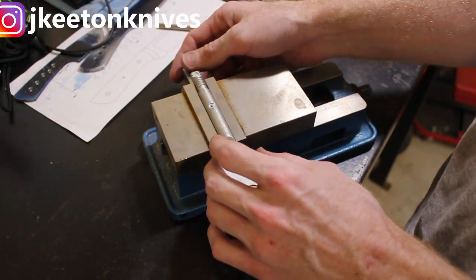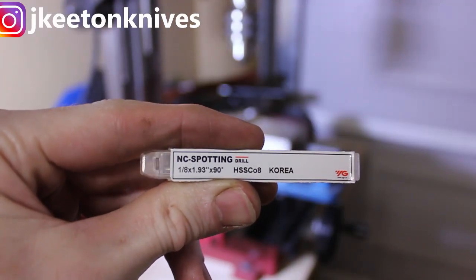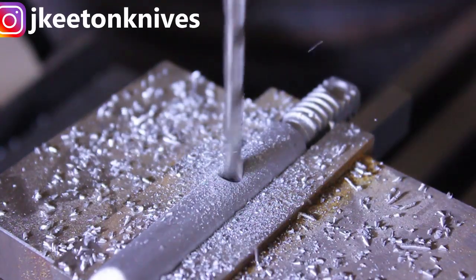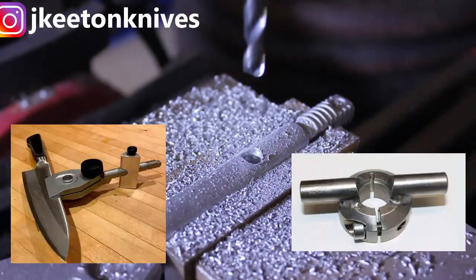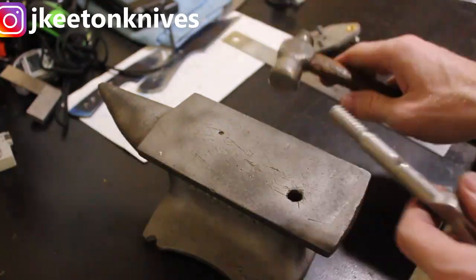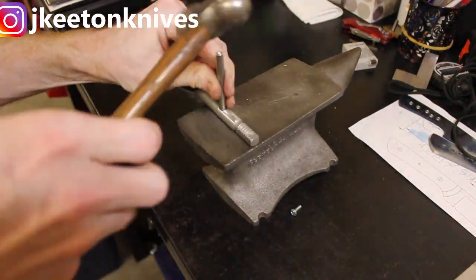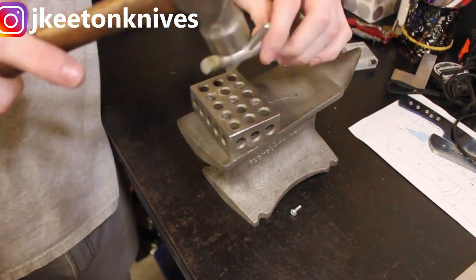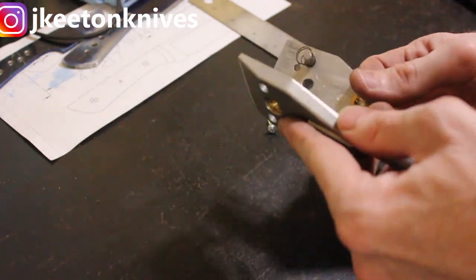There are modifications you can make to the knife grinding jig to achieve a consistent bevel angle. I'm using a quick and dirty brute-force method — drilling a hole in the jig starting with an eighth-inch spotting drill, then increasing it to 5/16 inch to accept a bar I had in stock. There are more elegant designs that allow you to move the bar up and down the length of the jig. I peened over the holes for a tight fit. So far I've sharpened about 30 knives with this jig and it's worked great. I actually use it without the black guide on the back, as I find that still gets in the way.